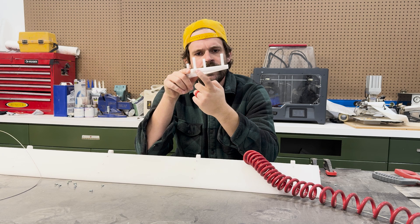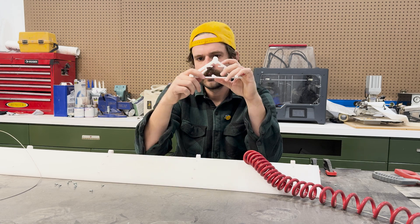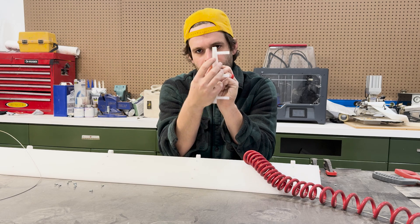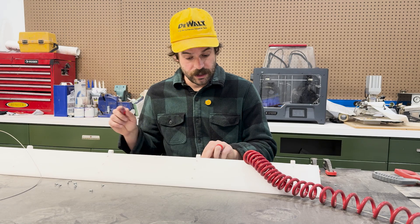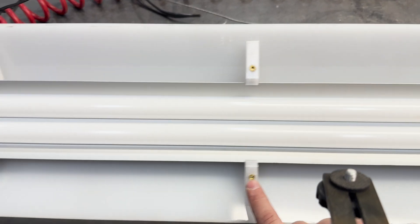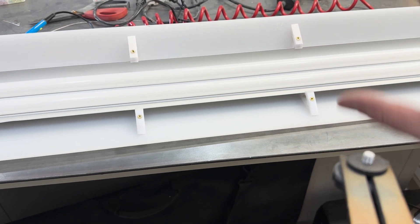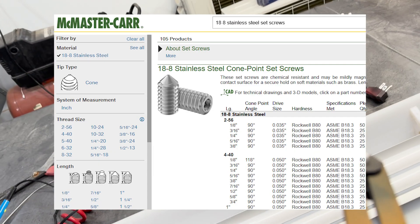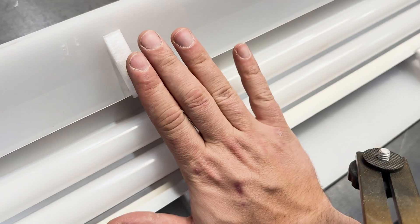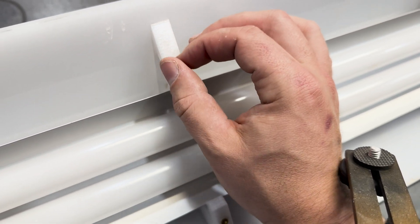These brackets are all perfectly spaced, so in an ideal world I could just take my 3D model and make a template of where to drill the holes on the acrylic panel. But on all of these brackets, the screw that holds the bottom panel on — I forgot to put the little hole for the Nutsert. So these holes were all kind of free-balled and weren't exact, so I couldn't print a template from CAD. Instead, I found these little spiky threaded screw guys, pushed the acrylic against them, and they gave me a perfect little dot to drill.